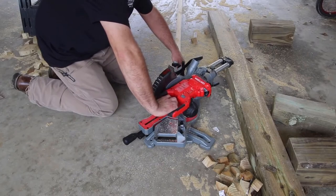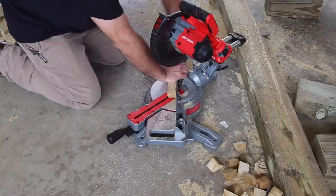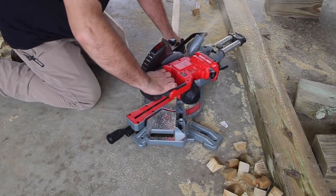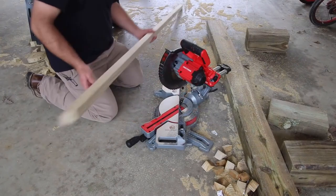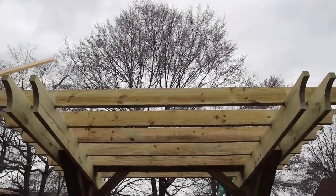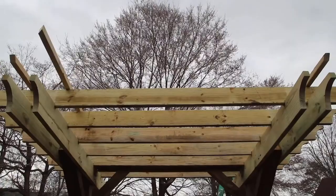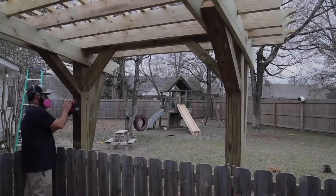There's one more layer to the top. I used my Craftsman battery-operated miter saw to cut each of the two by twos at both ends at a 45-degree angle, just to create some visual interest — I'd cut one end, flip it around, making sure both angles were going in a downward direction. I placed these evenly across the top of the two by sixes and nailed them directly through the two by twos with a two-inch brad nail. This tied everything together and really secured the whole assembly.